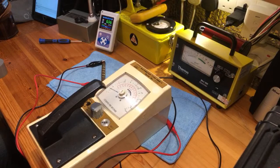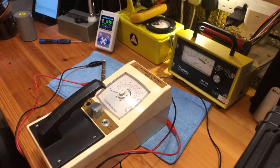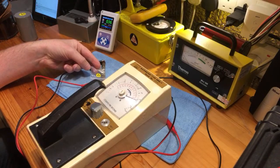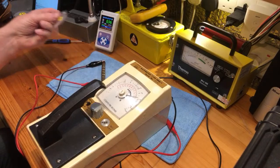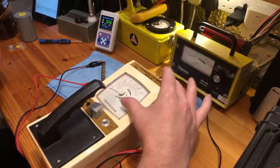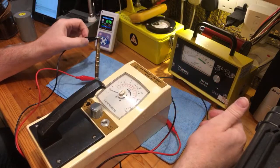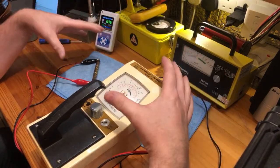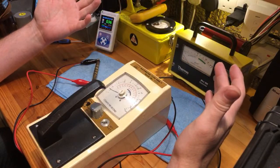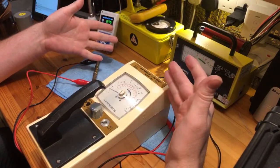If I take a piece of Strontium-90 — there we go. So we have a working Geiger counter, detecting in counts per second. Total value: about £10 for this meter on eBay and £12 for the SBM-20 tube — that's £22 for a working Geiger counter, and everybody should have a piece of wire lying about. So you can make yourself a Geiger counter for £22. If that's not the cheapest Geiger counter in the UK, I don't know what is.